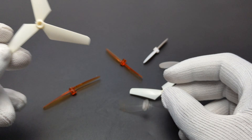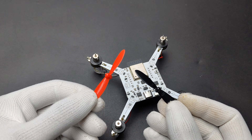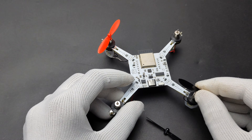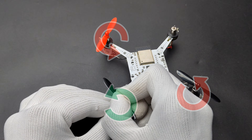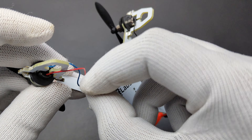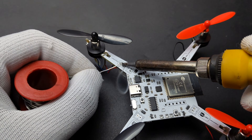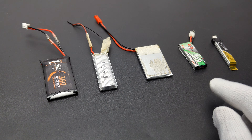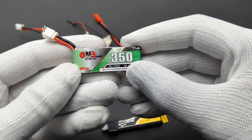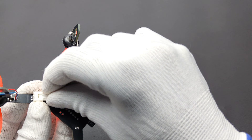The final step is adding the propellers. I tested different shapes and sizes of propellers and got the best results with 55mm propellers. So I added the propellers to the motors. You have to be careful about the propeller direction — please follow the article for that. For the battery, we can use a 3.7V or 3.8V lithium polymer battery, but make sure the weight is very low and the discharge capacity is a minimum of 25C. The discharge capacity is very crucial — if it is not enough, the drone will not work.